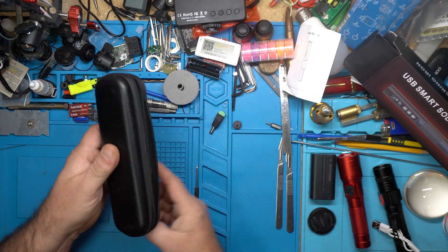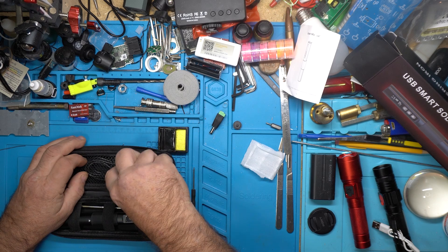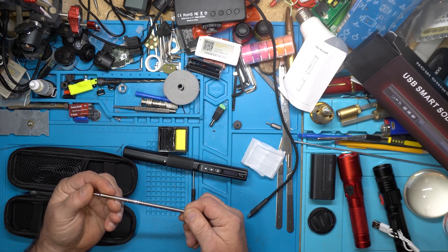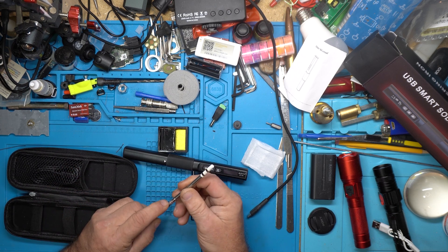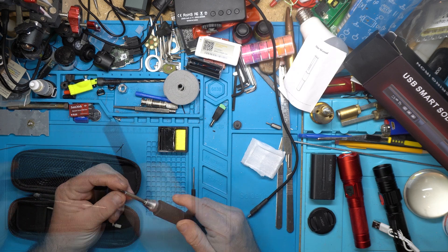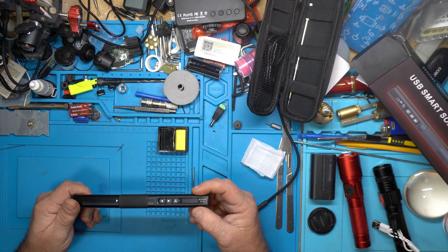So let's check out the iron. It comes in, in my opinion, a nice case. Again, I always call them an afterthought because there's really nothing to the holders. Comes with a cable. Here's the two tip. It comes with a very sharp pointed, what I call a standard tip. This is a T-12 ILS tip, and I believe what it has is what I call a chisel tip or a wedge tip. You'll notice that this iron is suspiciously like the HS series irons.